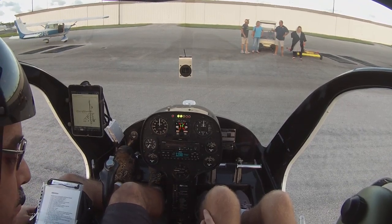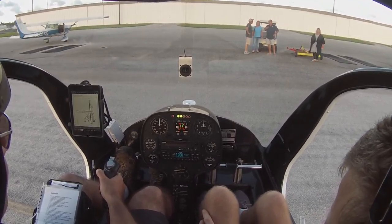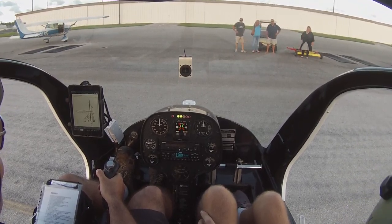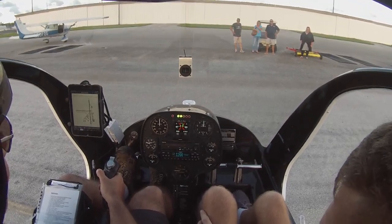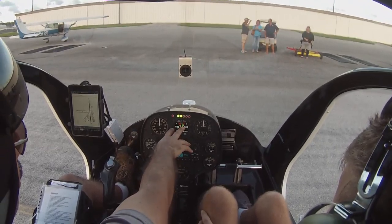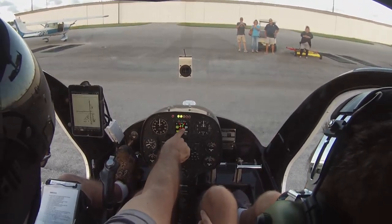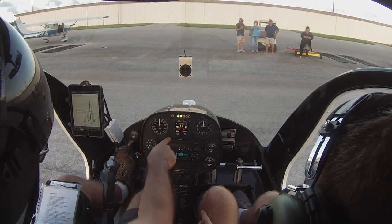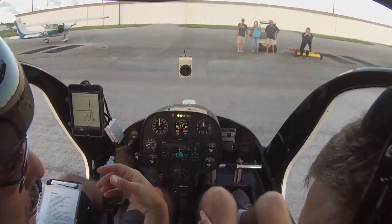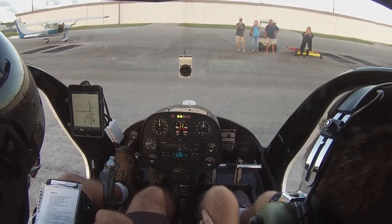All right. And then before we take off, we run the engine up to our operating RPM. All right, we've got 100%, and I'm going to roll it off gently to make sure that the engine doesn't bring down the rotor, which is on the left here, which is the main rotor. So we roll it off, and the engine comes down, and the rotor slowly comes down. And that's so we can get into something that's called auto-rotation. That beeping noise is just saying, hey, it's low. It's to tell me, hey, something's wrong. So it's an alarm. And we're testing all of that here.